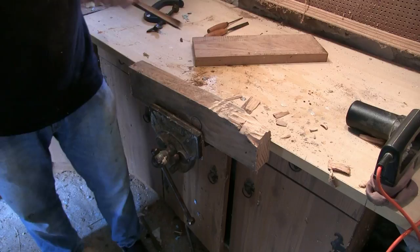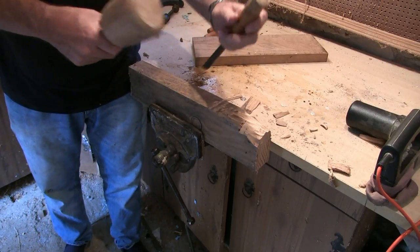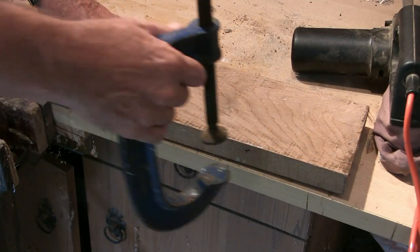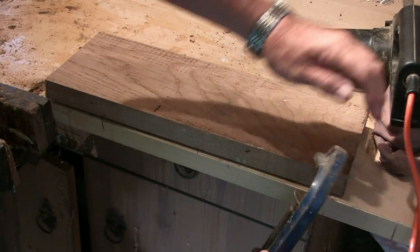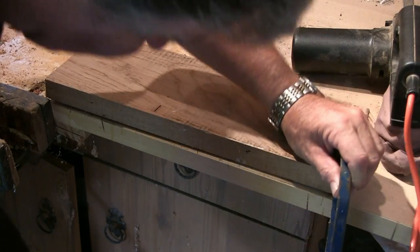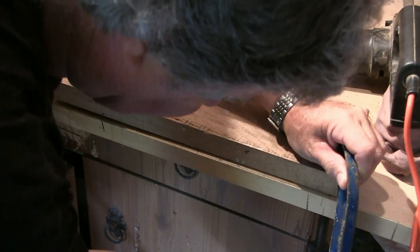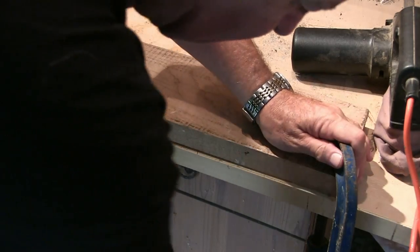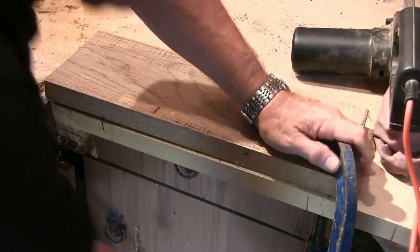It's great fun but you've got to go with the flow of the wood. You notice I'm always working away from myself - I never cut towards myself unless I have to. With your G-clamp on, make sure it's not going to be in the way - you might prefer it even upside down. Don't have it in the way of your carving; you've got to move things around. If you want, put a bit of waste wood between the G-clamp and the wood to stop it making a mark. Now I'm going to talk about lettering and the patterns we can make with these tools.